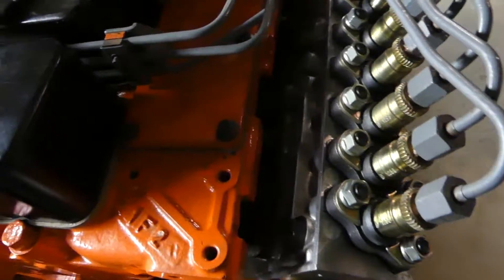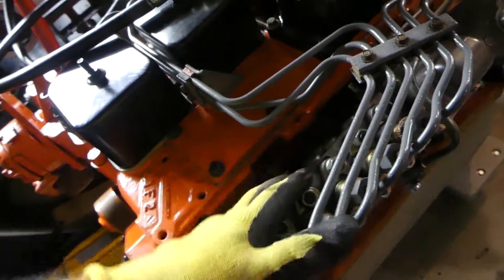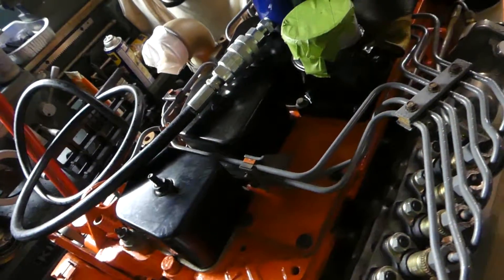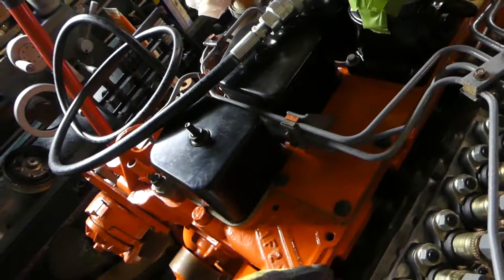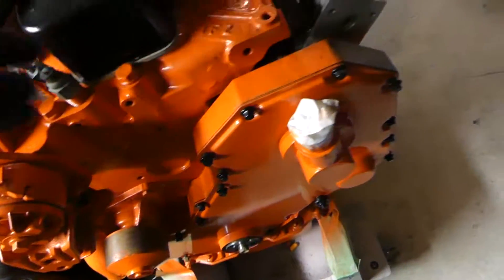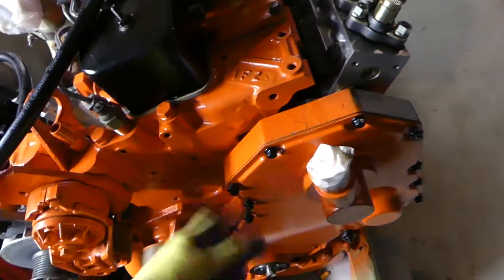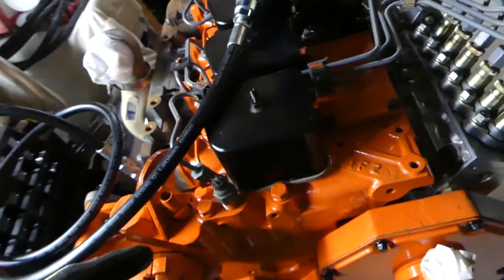It basically should back-feed all the way to the pump. The pump has an oil port — it's got a hose right in there, hard to see in this light. So we're going to make sure that that's got oil in it. You can tell if this cover is not tight, so we can actually just pump a little bit of oil through there and we should get oil squirting into here. If we just loosen this off and pull this off, we can make sure it's loose and has oil.